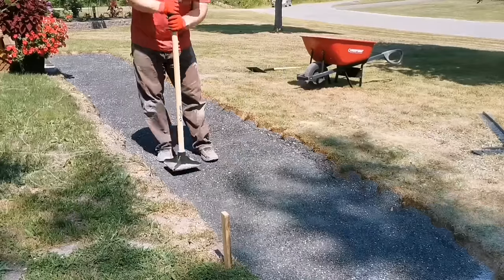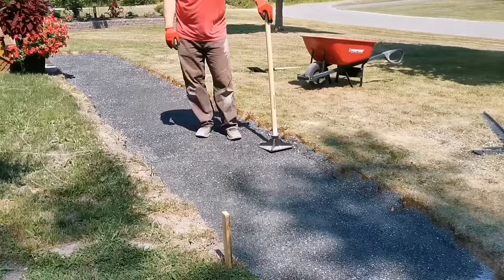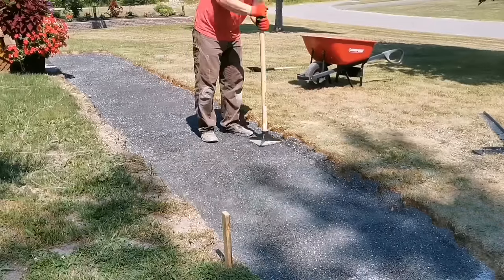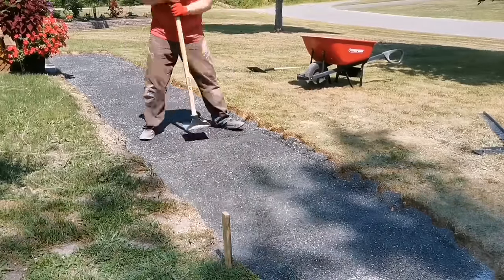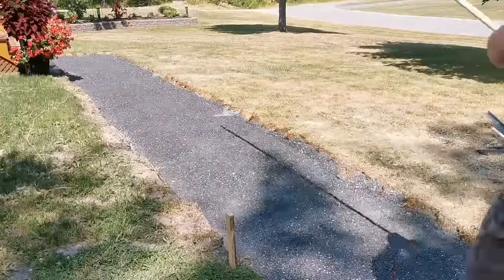Here's the compactor I bought at the hardware store — it's about a 30-pound compactor, pretty cheap actually. If you don't mind the manual labor it doesn't take that long and it does a good job. Make sure you water it down first to get much better compaction.